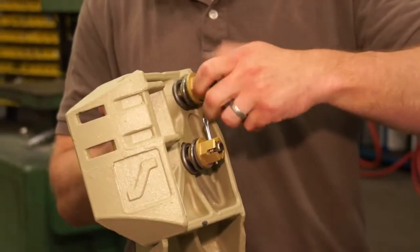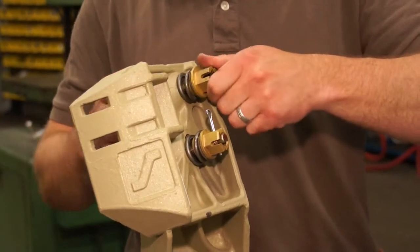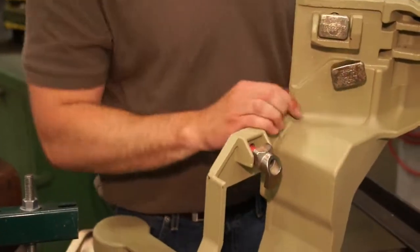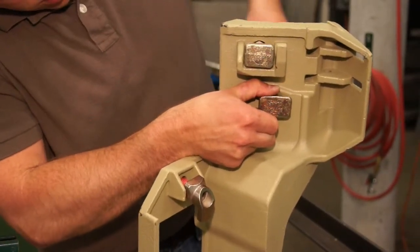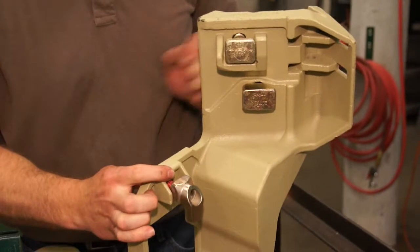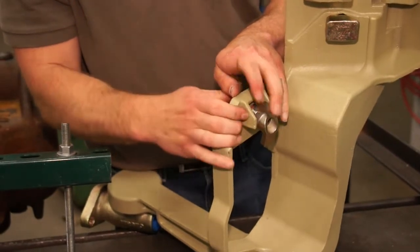Next, loosen the top spring retainer assembly so it is close to the ends of the threads. Now hand tighten the bottom spring retainer assembly and rotate the clamp so the clamp body is parallel with the top of the bracket. This is important for easy installation. Next, loosen the bolt on the axial mounting clamp until the end bolt is flush with clamp face.